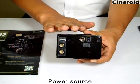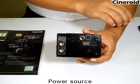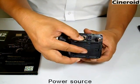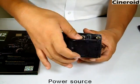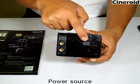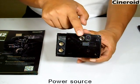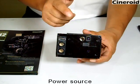This new EVF can use two kinds of power sources. One is battery — you attach a battery mount and can use many kinds of batteries. You can also use external power through the mini XLR power input connector, which accepts from 6V to 17V.